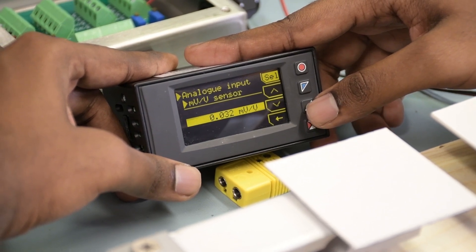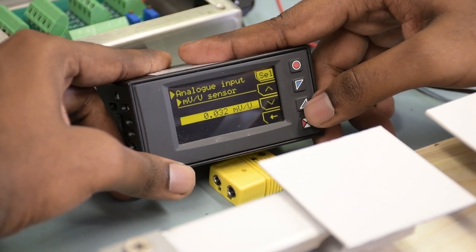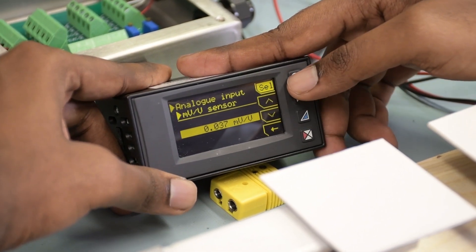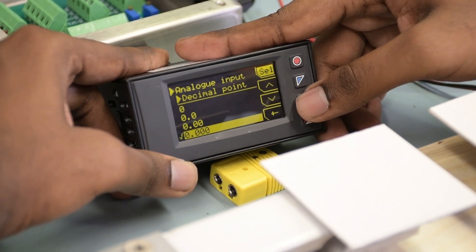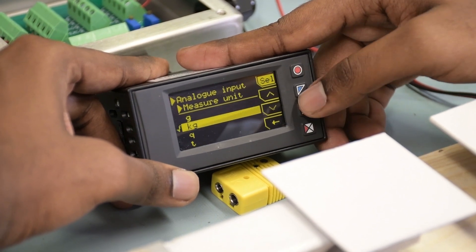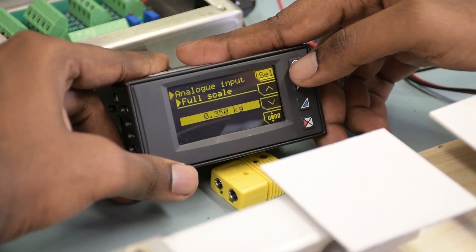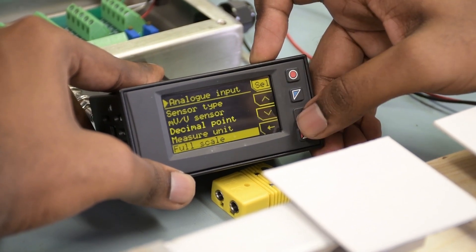Common excitation voltages are 10 volts DC. In our case, 0.37 divided by 10 gives 0.037, so I'm entering 0.037 millivolts per volt. Use the up and down arrows to change digit values and the menu button to scroll through digits. Hit Select once the value is stored. Scroll down to Decimal Point — select 0.000 for maximum resolution. Select Measurement Units and choose kilograms. Scroll down to Full Scale and enter the value you want to see when load is applied on all cells simultaneously. I'm entering 0.378 kg and hitting Select to save.